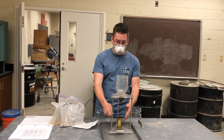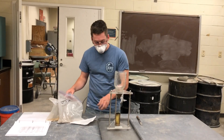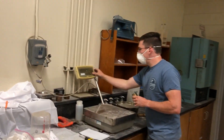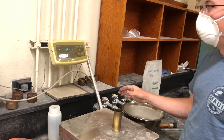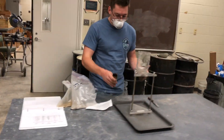So what we'll do is scrape off the top and weigh it afterwards. I'll go ahead and do gravel first. I want to weigh the cylinder first. The weight is 185.1, and I'll record that value.